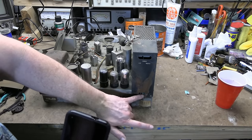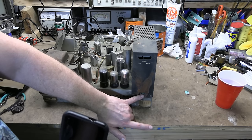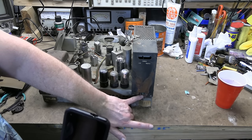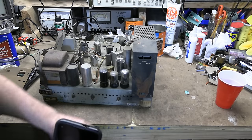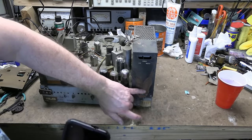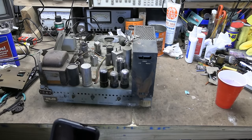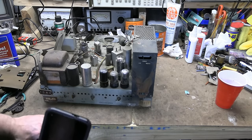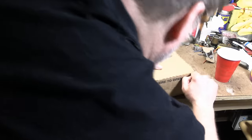It's also possible that when corrosion starts down here, you start getting electrical resistance. If you turn this set on, this can get hot and the plasticizers in the plastic can start smoking — maybe even catch on fire. So this could also be from the nasty chemicals burning off the plastic to cause this corrosion. I'll do my best to clean this off; I may have to replace this AC interlock. But first, let's see what the capacitor fairy brought us.